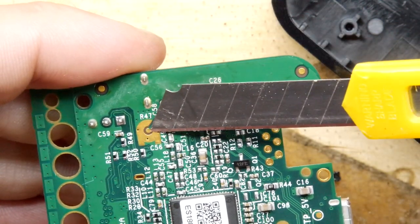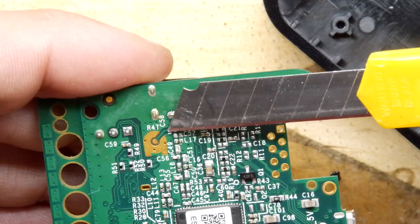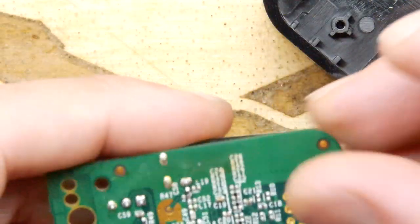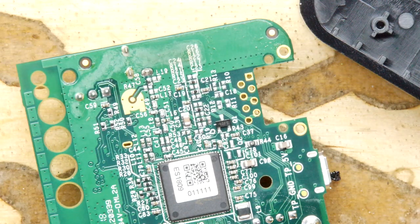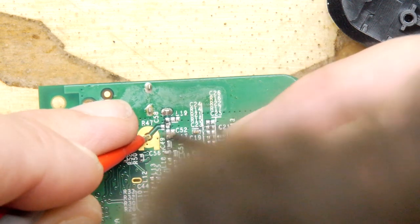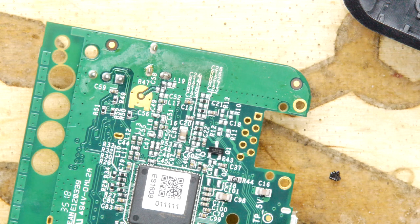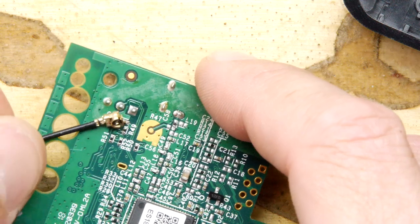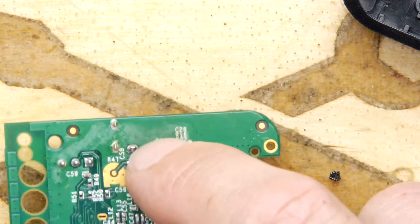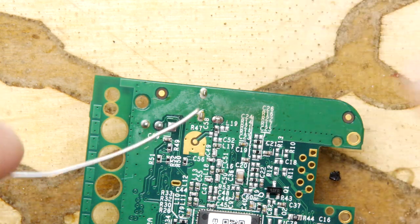Look at this — this looks suspiciously like an antenna port where you've got a ground and a center wire. I don't think that's connected — we might be able to buzz it out. We might have to move a cap. Yeah, it's not connected there — if you move this resistor from here to here it'll work. That's probably a zero-R resistor. But there's little point in doing that because I don't actually have the receptacle for it, so I'm just going to use those three pads to unsolder the existing thing.